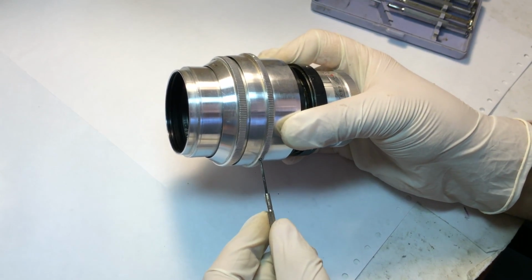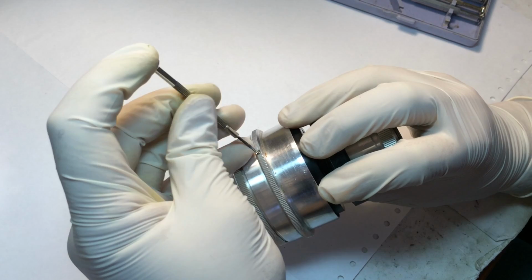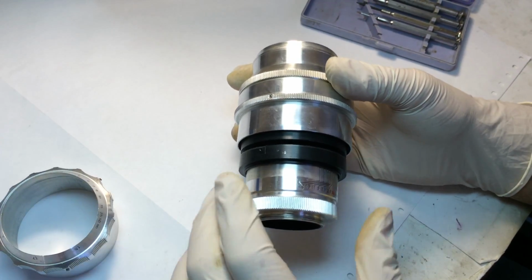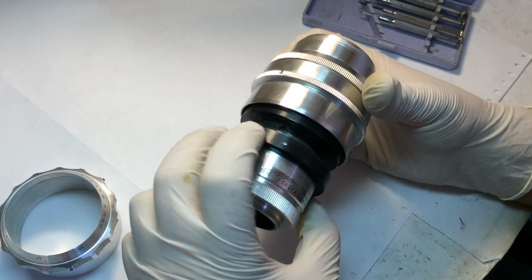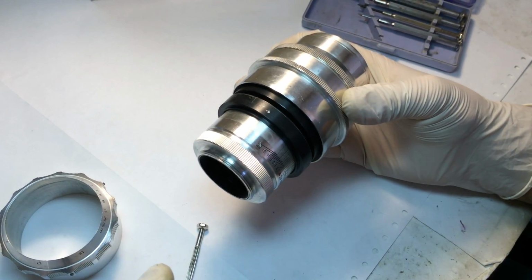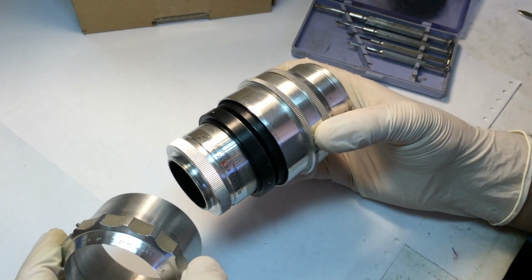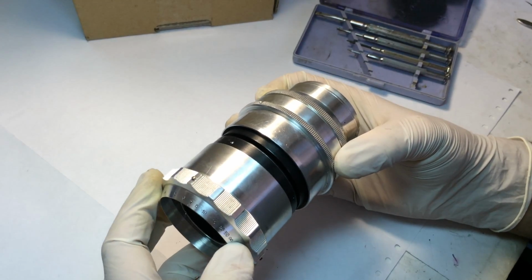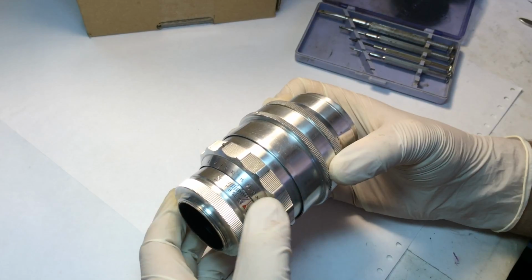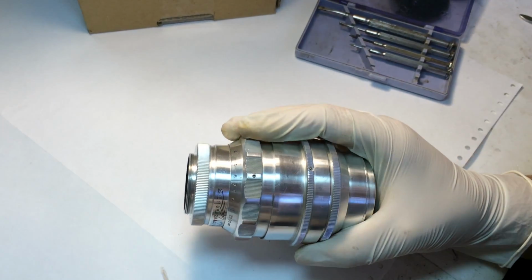One, two, and three. And then what we have to do is to put the focus control ring. So it's this ring you're turning to the two parts, the closest possible, and this is infinity position. And then you take your ring, you find the red marking here, and you find the infinity sign, and just you put them together so these two markings correspond one with another, and then you just fix it with the screws.